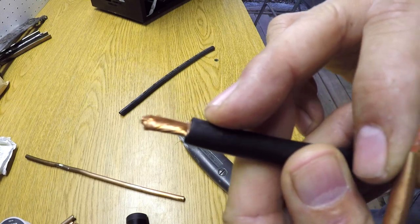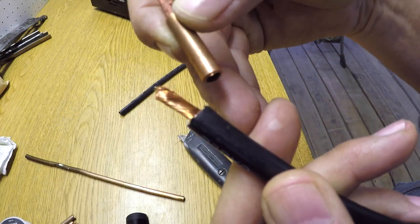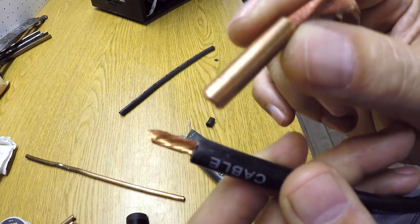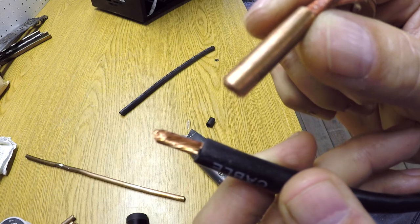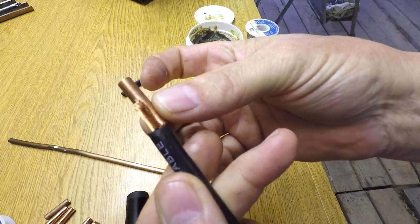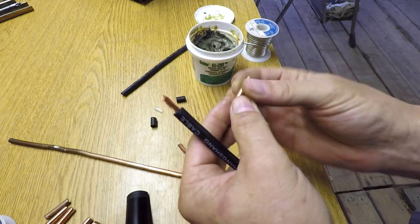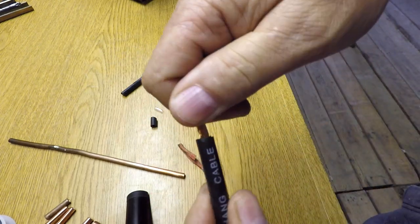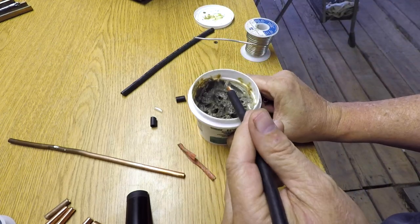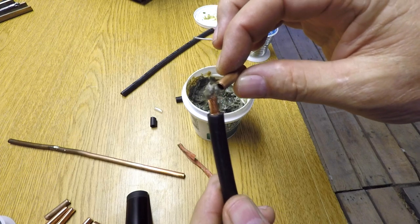That's the secret to the success in this because I'm going to be soldering these on. Some people will crimp those on there and that's fine as well, but I'm going to solder mine. So I'm going to get these cleaned up. Now that I have it cleaned up, you can see how that's going to fit about halfway into that pipe. So I've got the end of the wires kind of twisted up, and then I'm just going to put them in my flux and try to get a little bit of flux inside the tube.